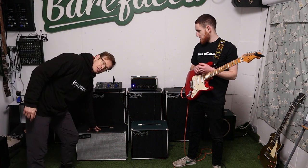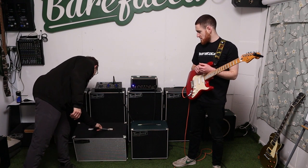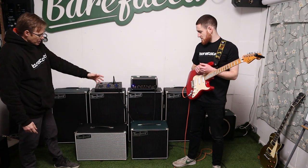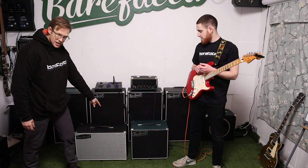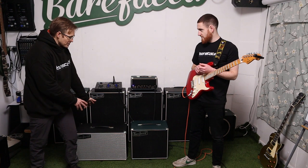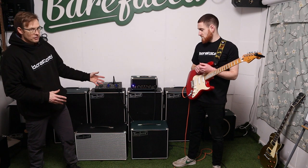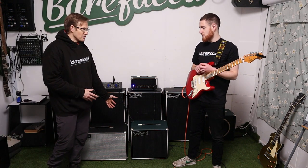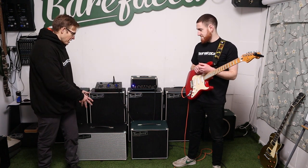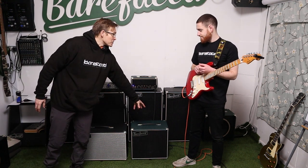So this has more enclosure volume. And this has less enclosure volume. The AVD on this is slightly less tall vertically. The sum total of those two things should mean that the Helmholtz resonance on this is at a lower frequency. So this resonates deeper. So the low frequency gain you get from the low frequency component of the AVD should happen at lower frequencies with this. And I think that's what we're hearing. We're hearing more reinforcement up towards the mid bass, low mids with that.